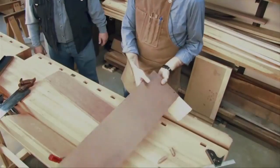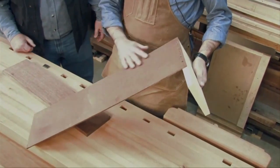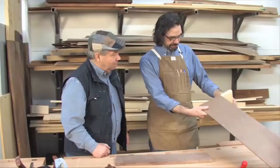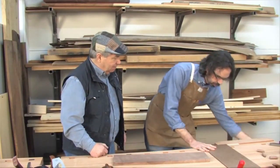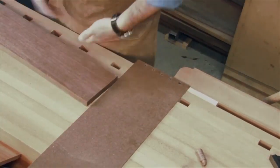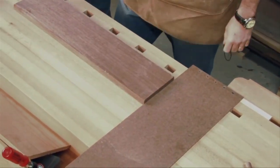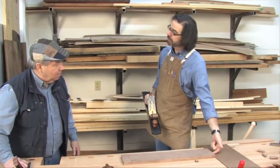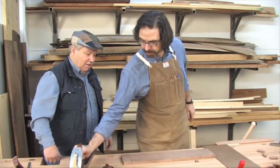What we've got here is a planing stop. Unlike a really fancy blacksmith planing stop, this one is just a quarter-inch masonite, drywall screws, and a 1x4 screwed together in an L shape. What this planing jig allows you to do is work without a tail vise. We can plane entire wide panels by just butting it up against the masonite, and we can plane really, really thin stock — which is one of the downsides of planing against dogs. It's totally simple.